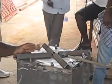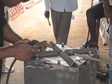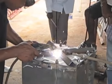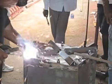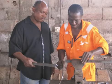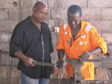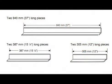Using thinner plate steel will make your diffuser ledge much weaker, so you will need to reinforce your base plate with longer square tubing or angular bar. Once you have all your pieces cut from 6mm plate, the next step is to prepare the angle iron. You will need to cut the angle iron into 6 pieces.